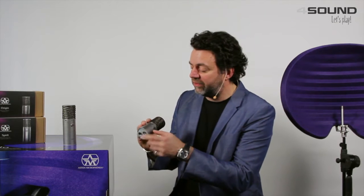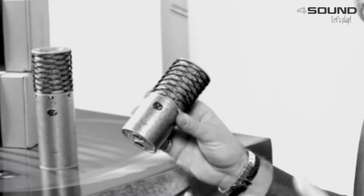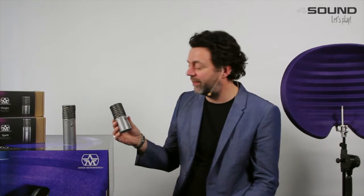And the only thing that is required in finishing this microphone from the raw materials is the actual chassis and the badge. And the chassis is a solid stainless steel 2mm thick cylinder, which we've then put in a big tumbling machine with other bits of metal for about 4 hours, and it gives us this beautiful patinated finish. It's very, very hard wearing. It's almost impossible to scratch. It doesn't fingerprint, and it'll look just as good in 10 years' time as it does today. So we've actually made an improvement from paint or nickel satin finishes because it won't scratch, it won't start looking shabby after a few years. It's much harder wearing, and we reduce the cost. Good engineering.